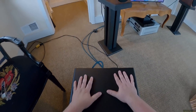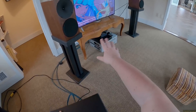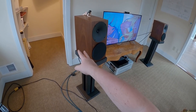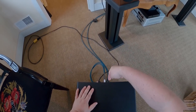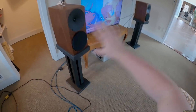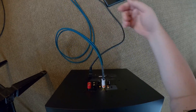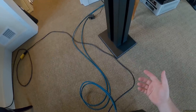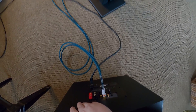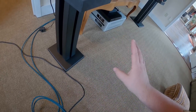One of the biggest problems with setting up a 2.1 system in a makeshift way is that you want your subwoofer to take over the low end, but the speakers aren't giving it up. Right now the way this should be set up is RCA outs into those speakers — but they're getting XLR and I should have switched them out before this review. If you feed it full signal in, you flip your switch to determine the size of your speaker and how much bass you want to give them.